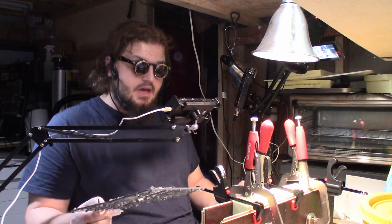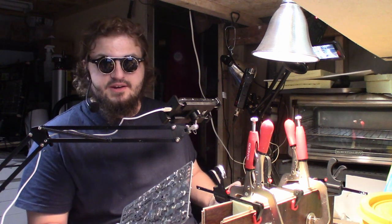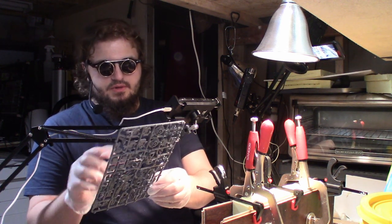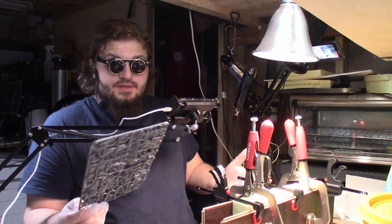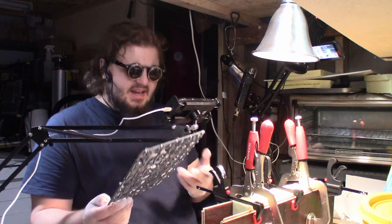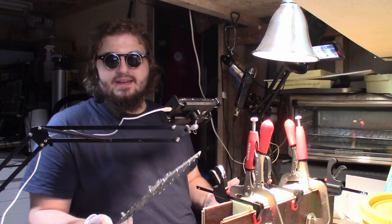Now you have to remake the entire sprue just for those few pieces. And if you have the whole sprue, you might as well just build the whole unit out of it, right? So instead, what I had done is I had split up the sprue into individual components, into 4 or 8 slices, and just made individual molds for all those. And the results actually do turn out quite well. The only downside is that it just takes extra time. It honestly would be nice if we could perfect a method that gets you great results from one single sprue right away.